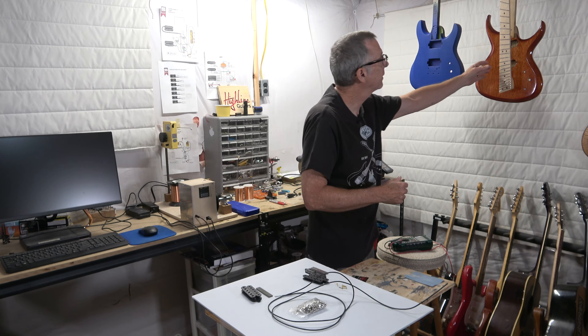I'm going to bring you in closer and show you all the parts that will go into this, and then we'll start winding the bobbins on my CNC pickup winder. Here are all the components for these two humbuckers — the bridge humbucker components over here and the neck humbucker components over here. I've also got two-conductor shielded wire for the lead wires, some phillister screws which are the adjustable pole screws for both bobbins, and some non-ferrous brass screws that attach the bobbins to the base plate.